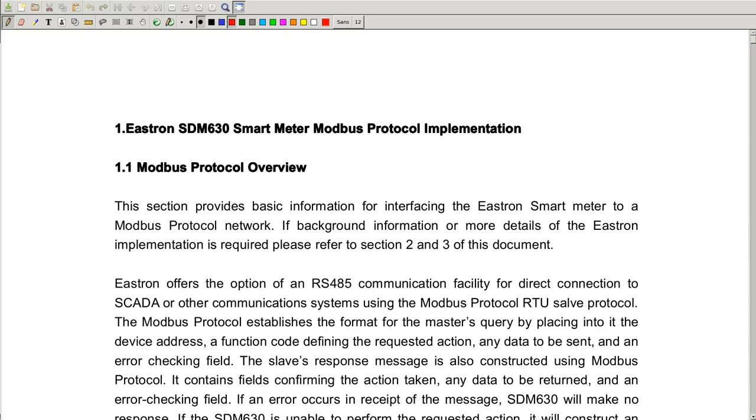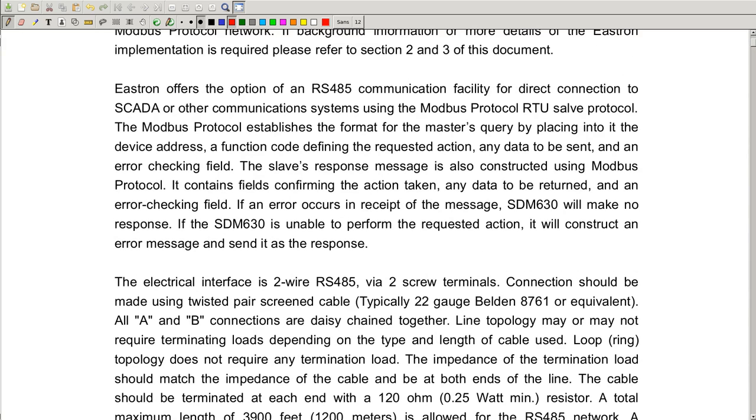The SDM-630 is a three-phase electricity meter which is a bit more expensive, but its manual has a much better description of the Modbus RTU protocol — covering the RTU format, RS-485 usage, input registers, and so on. What I wanted to look at is the Modbus protocol message timing. What I wasn't aware of is that in RTU mode, messages should start with a silent interval of at least 3.5 characters, where one character equals one byte. So you have to wait at least 3.5 byte-times before sending anything.